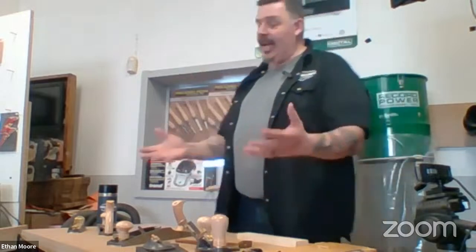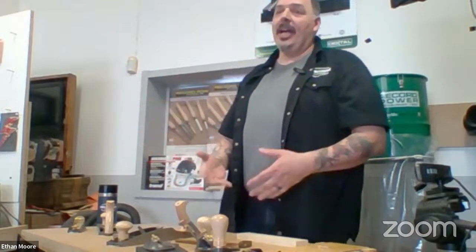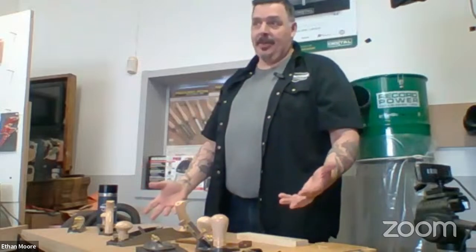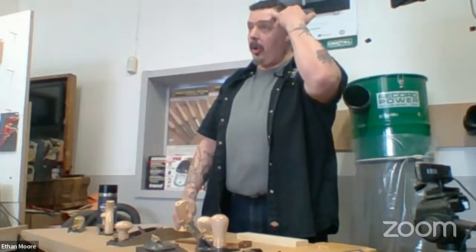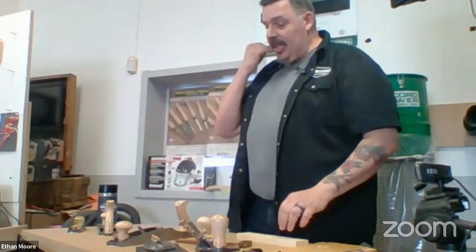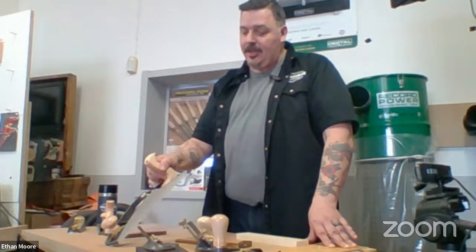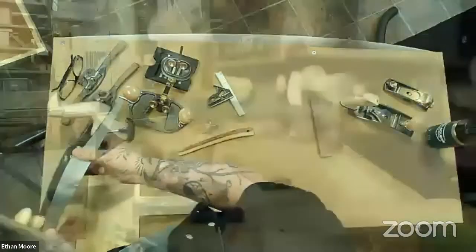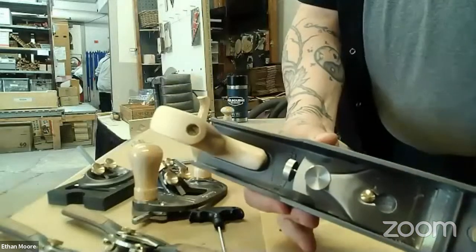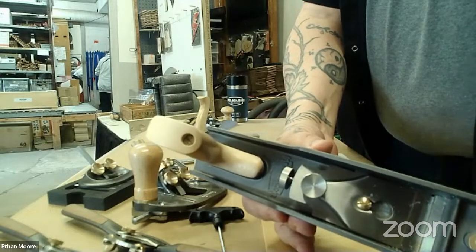They went to them and said, 'Can you make these?' They scratched their head a little bit, there was a bit of humming and hawing, and they said they would give it a try. What they came out with was pretty impressive. They're holding tolerances of three thousandths of an inch, which is pretty much the standard for hand planes. The castings are incredible because they're using investment casting, which gives you the best quality cast. It may look like these planes are painted gray, but actually they're just clear coat — that's the surface you're getting from the casting, which is pretty incredible.